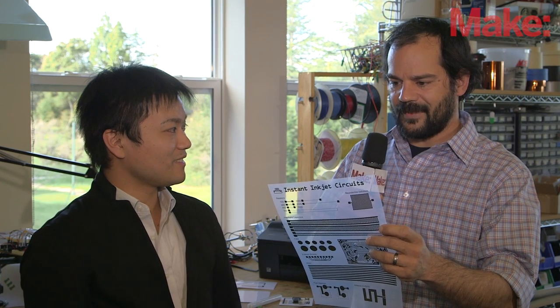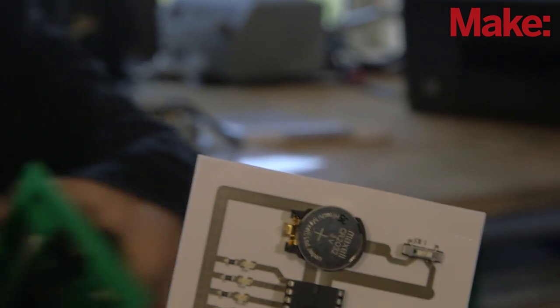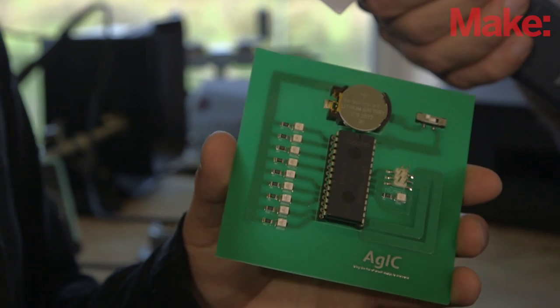I can immediately think of a lot of applications for something like this, but tell me, what are some of the first things you guys have started to do with this? I think this works best for prototyping. This is a circuit to test the microcontroller — before, I had to order PCBs a lot of times, and if you find a mistake, you have to reorder it. But using this technology, you can print in a few seconds and revise in a few seconds, and verify the circuit works. After that, you can just send the Gerber data to a PCB manufacturer, and it works.